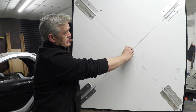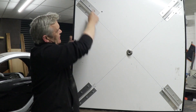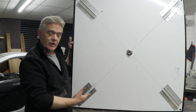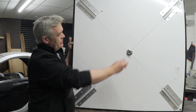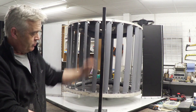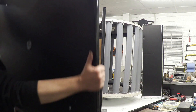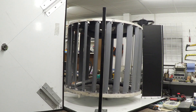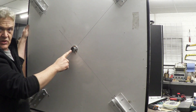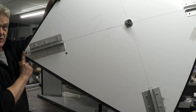From the aluminium honeycomb I cut two one-meter sections as a top plate and a base plate. I did diagonals at the center, and I've got a socket to take the axle of the turbine. Then I put aluminium angles here - these were recovered from a display stand - on those diagonals, and we're going to put baffle plates in there in the same way that we did on the pallet, but this whole thing is now going to be freestanding. There's a 12 millimeter hole at the center socket and at every corner - and this is what I spent the other £15 on.